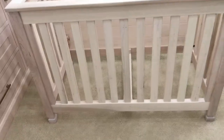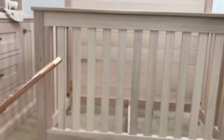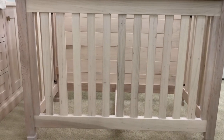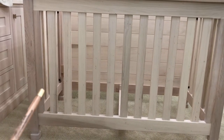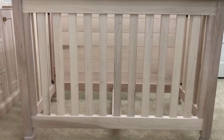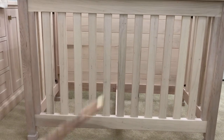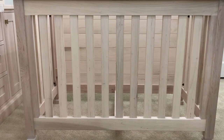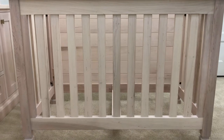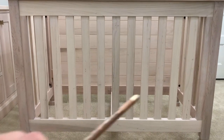And then on the front here, same thing really as the sides. The top, side, bottom, and side piece are 1.5 inches thick. These ones are a little bit more narrow. These are 1 7/16, the one on the very ends. And that just basically allowed the spacing and rails and the vertical pieces to be identical. So same thing again, all these vertical components are 2 1/8 inch wide. They are all 26.5 inches tall, and the gaps are all 2 1/8 inch.